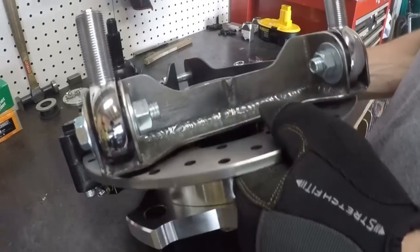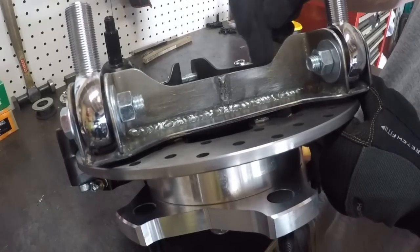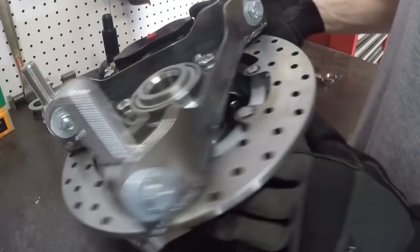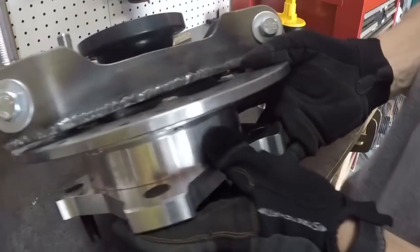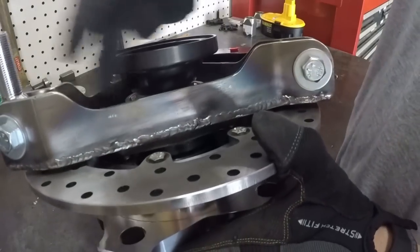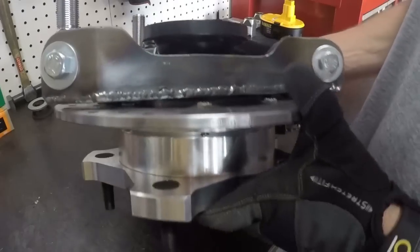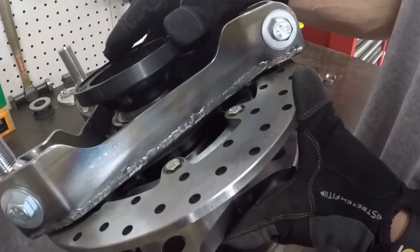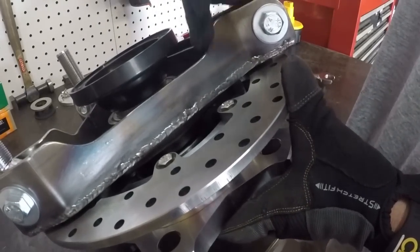Now, if you see, I did a couple things, like when I fabricated this piece running across here, I tapered it down here. I actually did that to all of these. I gave them a little taper down. Now, one reason that I did that is so that when you put the micro stub axle in, this metal here is 2 inches. And that actually fit. That's heavy. This actually fit. It didn't have to be trimmed down like that. This fit regardless. But that was two things. Number one, it was just unattractive. It didn't look good. It looked like the guy who fabricated it didn't care. And it also made tolerances around this really tight. So trim these down, radius all the edges. I think it looks good.